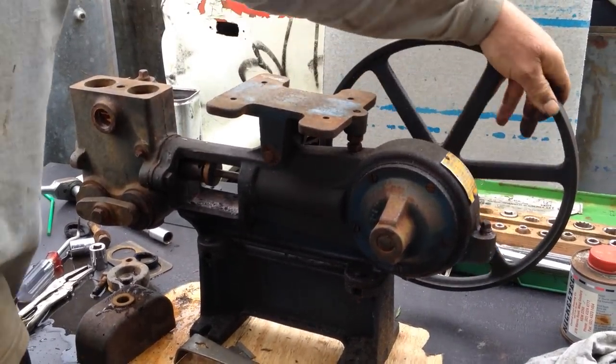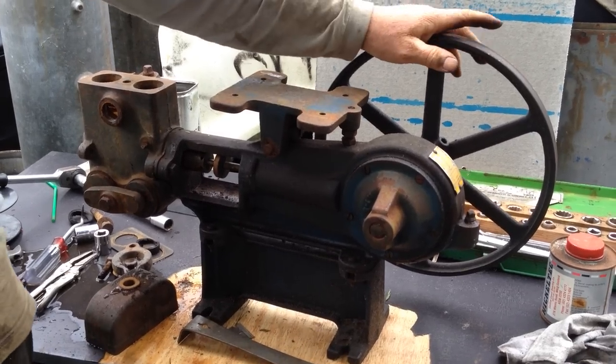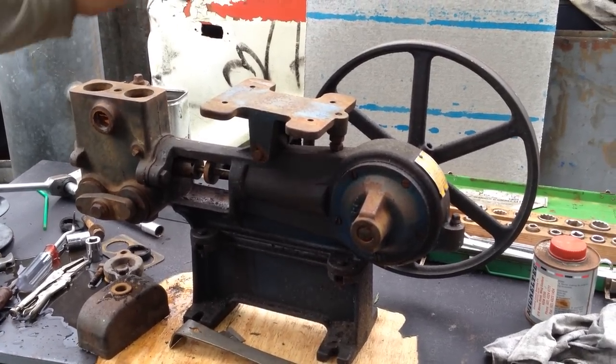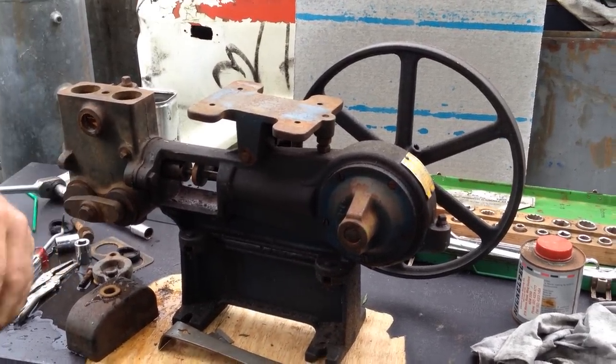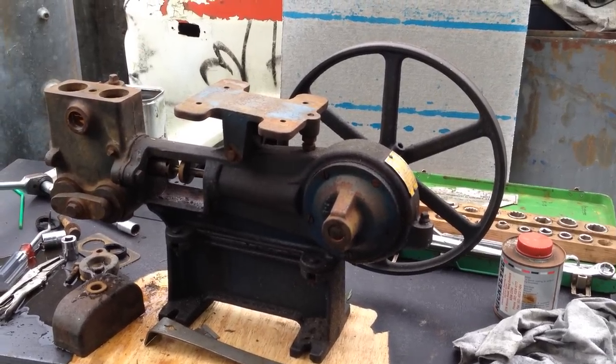1400 RPM motor on this side, 2-inch pulley, perfect size. That's about 100 RPM on the big wheel. Excellent. Don't go putting a 2800 motor on and bragging to your mates how quick it's going to pump, because you'll destroy your pump in about 2 weeks.